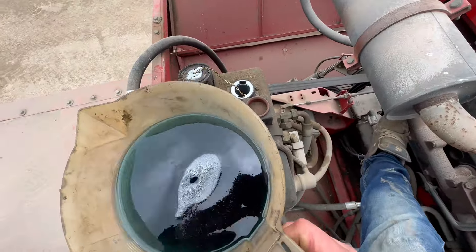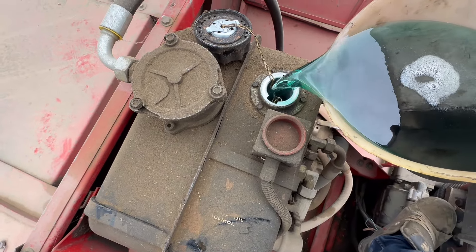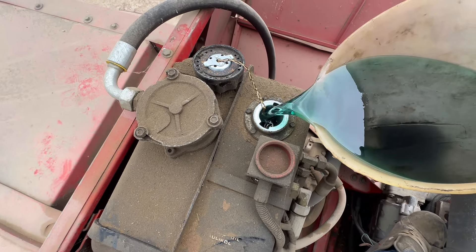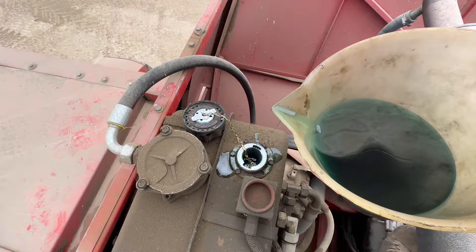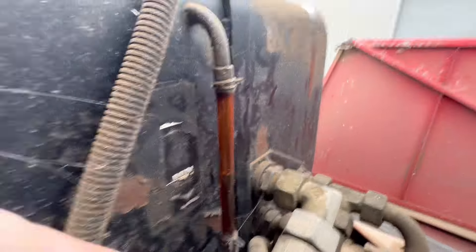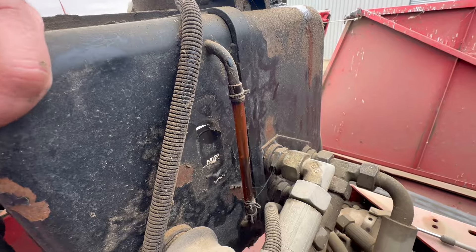So on the other combine that we haven't washed yet, it was a little bit low on hydraulic oil — so we'll just get that in there. This hydraulic oil's a little bit different because it can cope with a higher temperature. Good job I'm going to wash it. Just check the gauge — that's on the minimum now, so we want a little bit more to bring it up to the maximum mark. Probably another five or six litres.